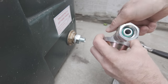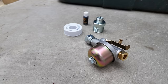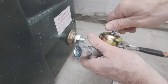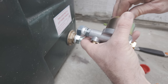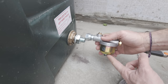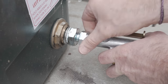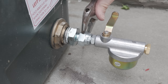This is a very important part of the job. Use all of what's supplied — it doesn't matter if it starts splodging everywhere. Then just tie it up and wind it in. This also acts as our valve — we've got a little ball valve in there but we've also got a small filter in here as well. These filters generally need cleaning every time the boiler is serviced, but for some weird reason I never see anyone do it. A lot of oil boiler services happen without anyone even taking the combustion chamber plate off. You should leave quite a nice gap on the bottom of these as well so whoever works on it can get an adjustable spanner under there. There's a little rubber seal in there so that'll always seal up.